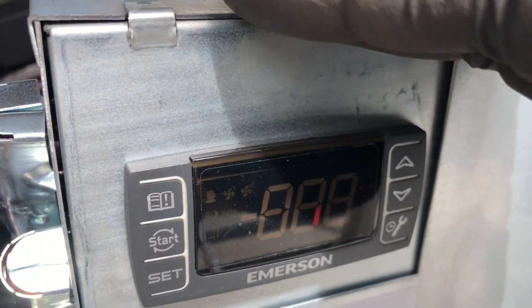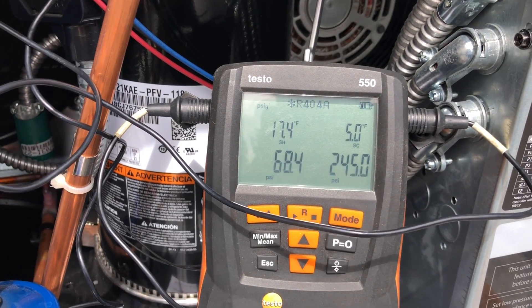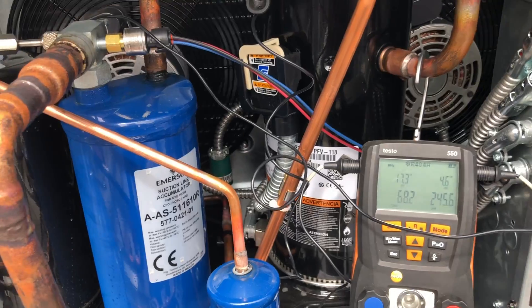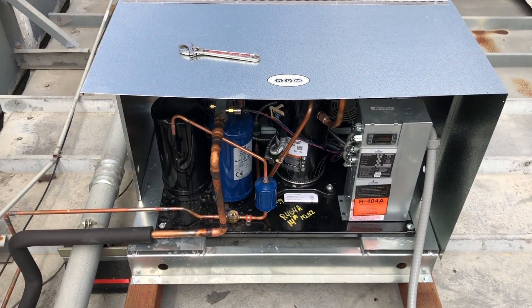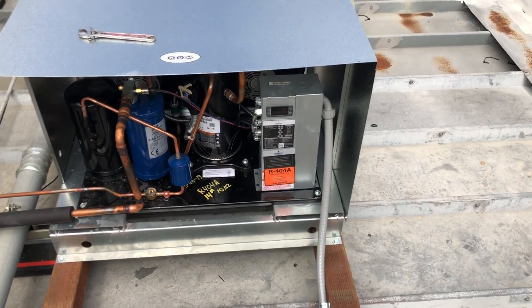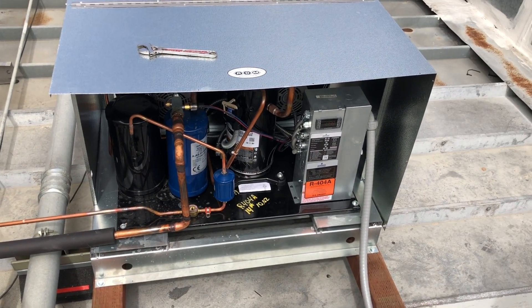It's an Emerson - 72 psi, 69. So they're within about 3. You can see the expansion valve - there's a little bit of gas down there right now. It's about 1:15, I'm all done, it's up and running. Kicked some ass on this one today. There really wasn't much to it. I like to weigh the charging on these units and write it on there - 14 pounds 10 ounces - only so if I come out on a night call I'll know if I have enough refrigerant on my van if it's flat. That's the reason I do that if you guys were ever wondering.